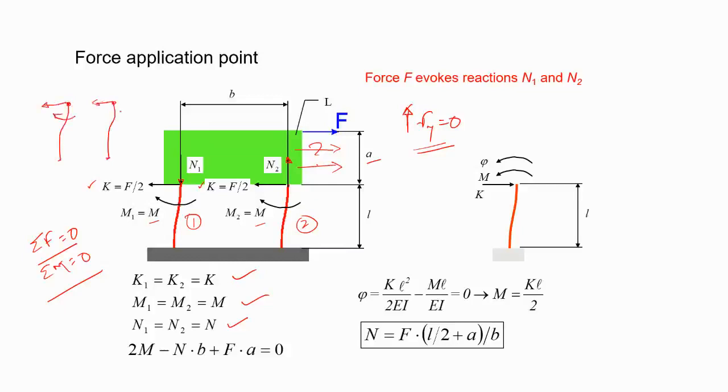I can also say this is same, but this is not same. This is this and this. Is like this. So just by looking at it, you realize that the external loading at the ends is not the same. Therefore, you can't say that the deformation will also be the same. No matter how small, there will be differential deformation. There will be different kinds of loading, and associated with that, there will be different deformations.